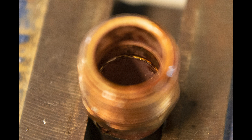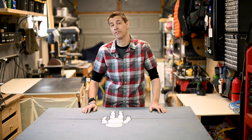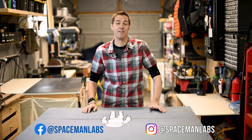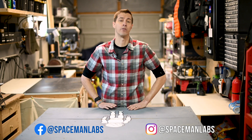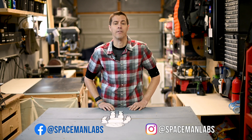After the whole piece cooled, we could take a look at the finer details. You can see that the capillary action worked really well — the solder was pulled all the way through the joint and actually overflowed using gravity, which was part of the proper steps. We ended up with a good solid joint that is likely to be leak proof. That about wraps things up for today. I hope you enjoyed watching — it was a lot of fun to make and I definitely learned some things. If you have any questions or comments, please let us know below, and if you want to be notified of future videos, please hit that subscribe button. Thanks, and we'll see you next time.